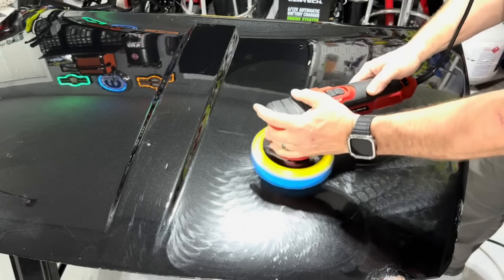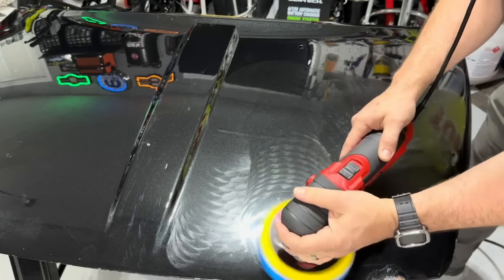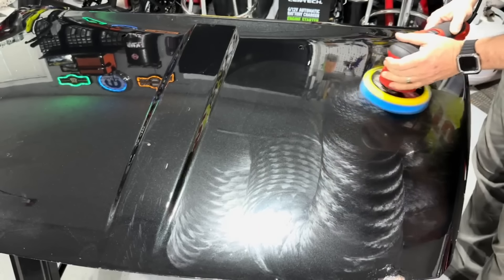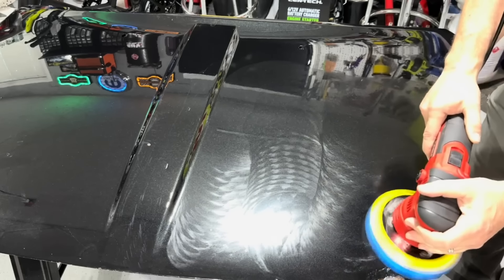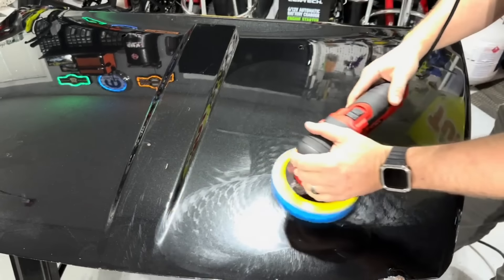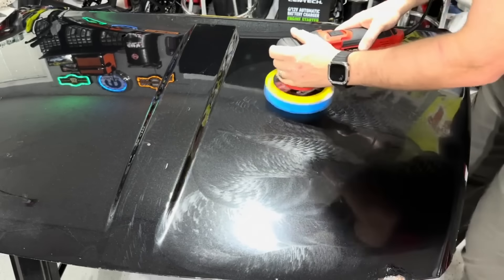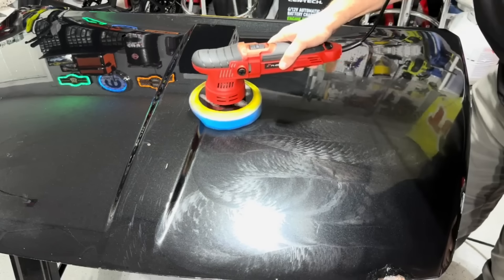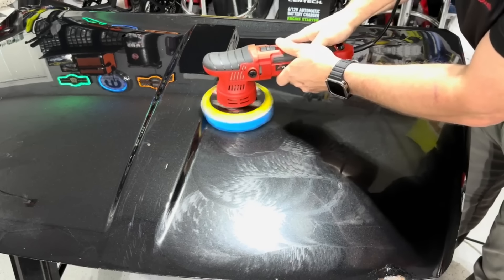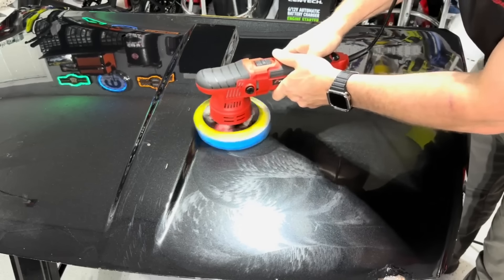I wish the handle was a little longer down here, but you can hold this however you want. I always use my thumb for pressure when I want to press down — I can put pressure that way and it doesn't bog it down. Let's put it up against this edge on speed two — it bogs it for sure, stalls it right there. Speed three stalls it a little bit. Speed four — you are not stalling it. That's impressive.